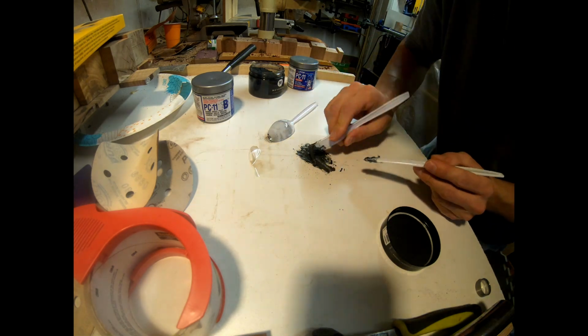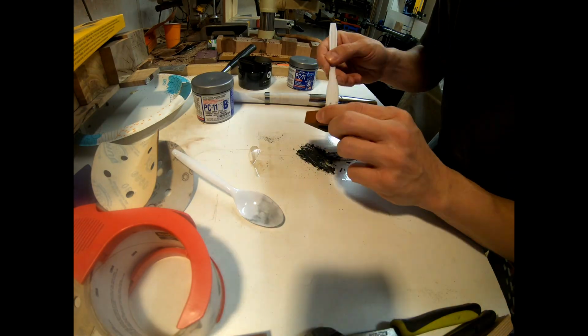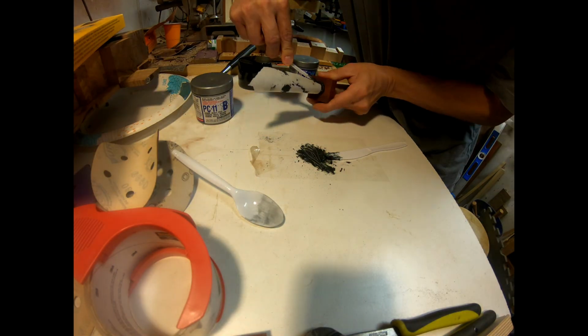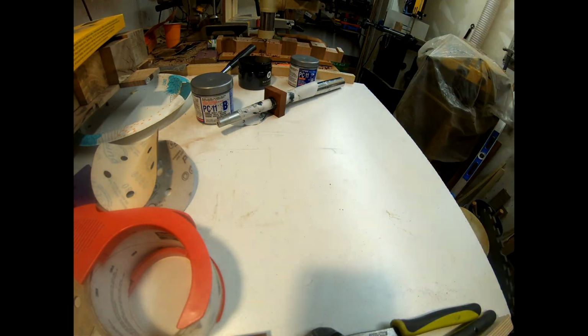To put the ring blank in the wood, I wrap some parchment paper around my ring mandrel, slather the paste on the blank, and then slip the blank onto the ring. The mandrel ended up being completely unnecessary this time, but sometimes after you get the glue on the wood, it creates extra friction or swells the wood or something rather than acting as a lubricator like it did this time.